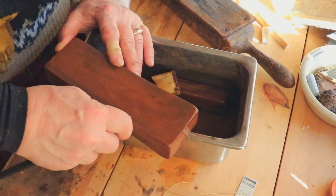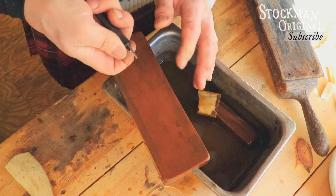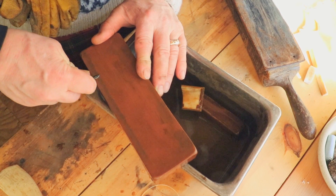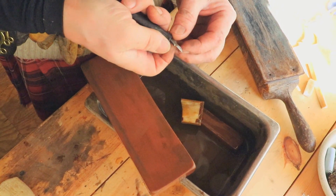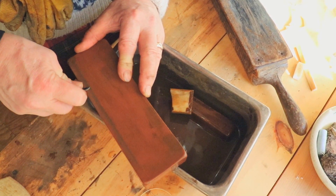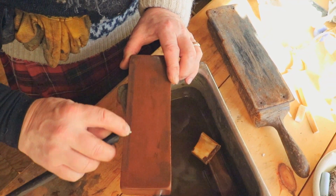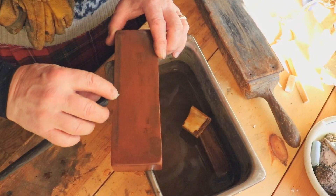I like to try to maintain the angle of the blade throughout the whole blade. So if I spend a few strokes here grinding the body of it back here without touching the cutting edge, I don't feel like I've wasted my time because that helps to maintain a thin blade — you don't want your edge to start getting thicker. Just the very point — on this particular knife that's the most important part, the tip — and I can feel that feather edge right up to the point. Now I just turn it around and do the other side.